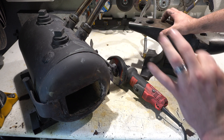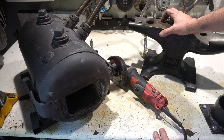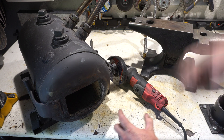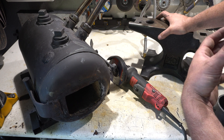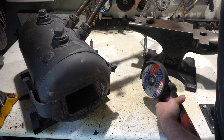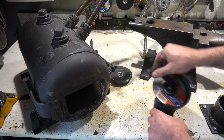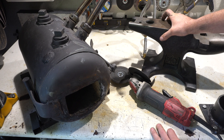To finish a blade you're going to need some kind of belt sander. If you're on a budget, go find a 2x42 — that means a two-inch belt by 42-inch long — which is a really popular belt grinder. You can probably get one for two to three hundred bucks. Yes, you could start with a disc sander, but they're just not very accurate and you will not have a nice product. You really need a belt grinder to finish a knife.